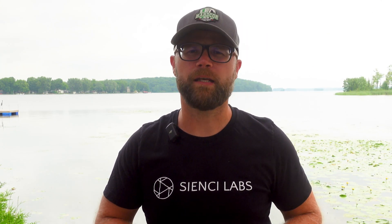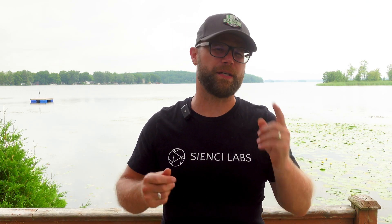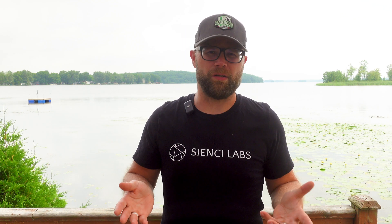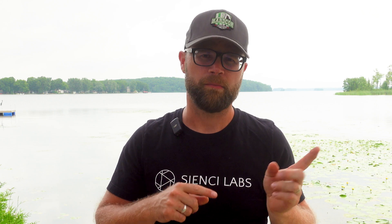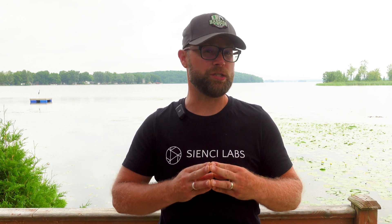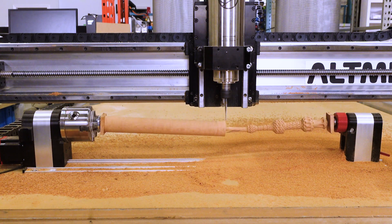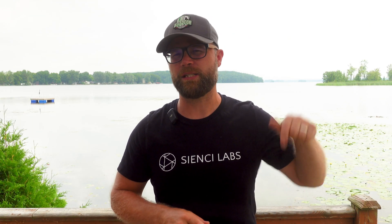Knowing all that, thank you for listening, and it's time to get to the actual tutorial. The whole point of these videos is to make CNCing more accessible, so that's why we're showing you the continuous toolpath method. You could set this project up just like the Vortex skull video we did, replace the skull STL with the bat STL we're going to provide you, and get basically the same result. However, there are times when the continuous toolpath can be faster or slower, and times when the bit cutting direction can be a deciding factor — for instance, when the toolpath cutting direction changes between climb and conventional, and causes the project to snap the giant wand you're attempting to make right in the middle of the carve. Go ahead, ask me how I know that can happen. We are all about expanding your knowledge base, so if you've got another tool in your CNC toolbox, we think that's a good thing. Now that you understand that, let's get this game started.